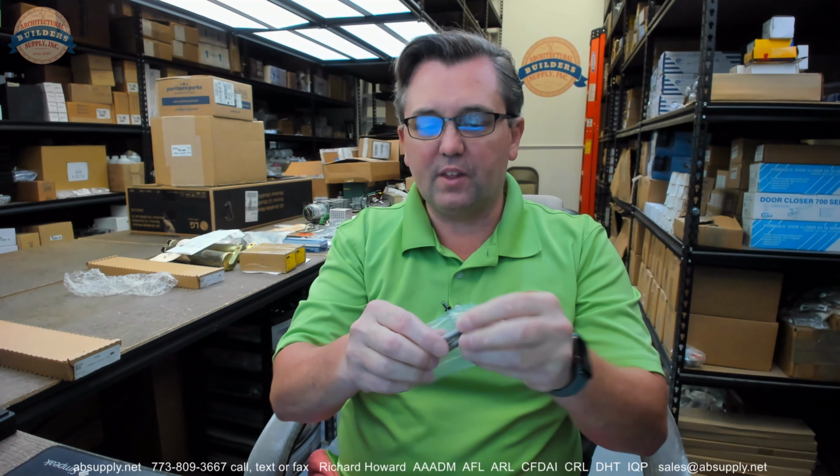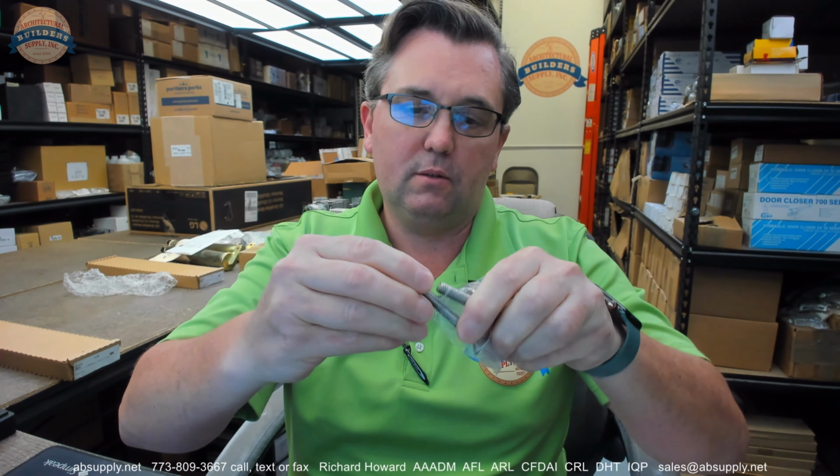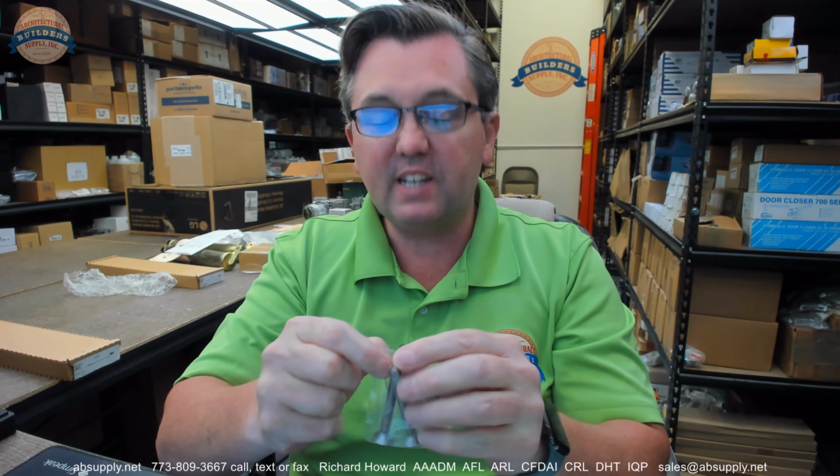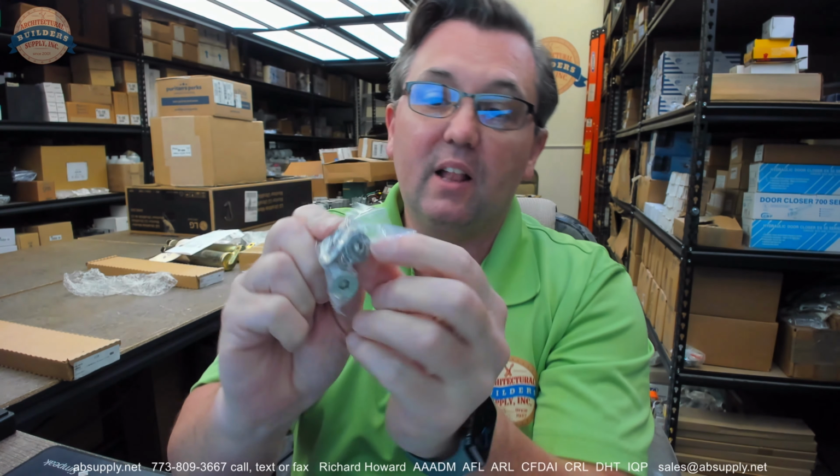Let me cure that curiosity first. Okay, so I know that what I have in my hand here is a 3/8 nut. Okay, definitely 5/16. The reason I was suspicious of it is I didn't know that they made the Allen drive in 5/16. I thought I had only previously seen that in the 3/8, which would be the XHD. Okay, so confirmed that this is certainly a 5/16 thread type.